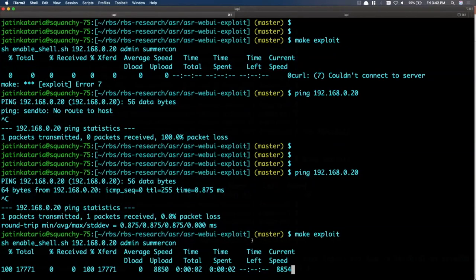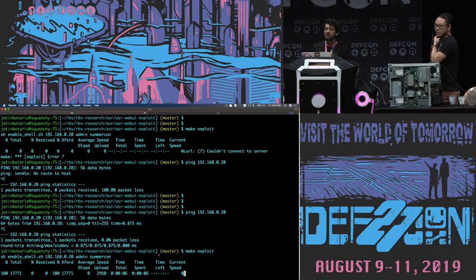So what it is doing right now is the James hack, getting root, and then we took a driver, which was crack.ko. I don't know why they wanted to call it that. But we hijacked the driver. We reverse engineered the CPLD driver, understood how the FPGA emulates the SPI flash for the Linux OS, and then applied the patch. You only require around 15 bytes of patch to disable the complete update and also disable the reset.